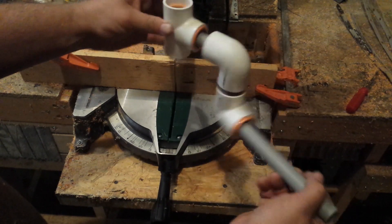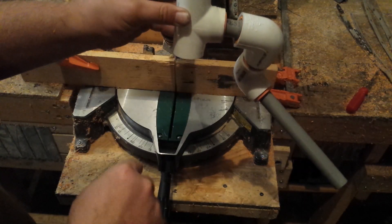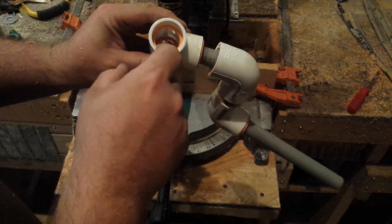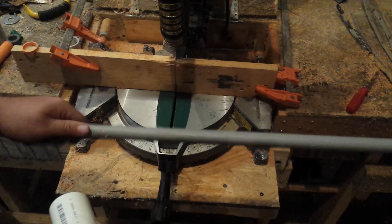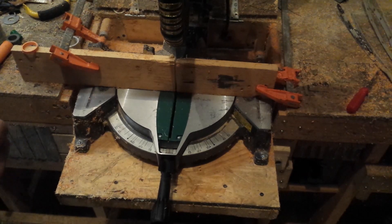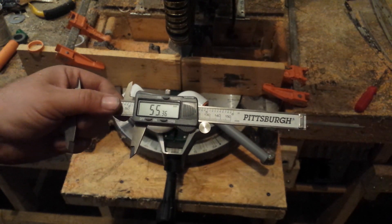Here it is with the handle installed and as you see it is very fluid. I've put both locking rings on the inside because I'm gonna put a bearing on each side to hold the boom more steady. It's very important that I line up where the bearings are gonna be on the half-inch boom. I'm gonna measure the distance and on my long piece of half-inch pipe I'm gonna put marks there and glue on two rings so I can build one bearing at a time. Using the calipers it was 55.36 millimeters and I'll go ahead and mark that on the long piece of half-inch pipe.